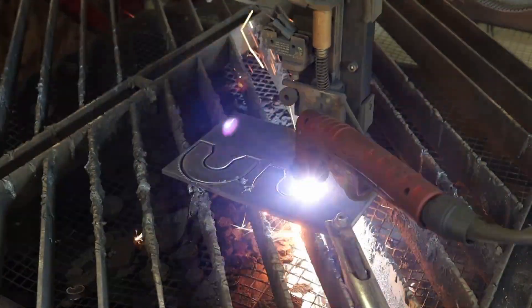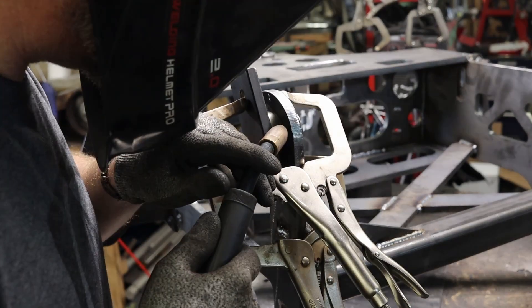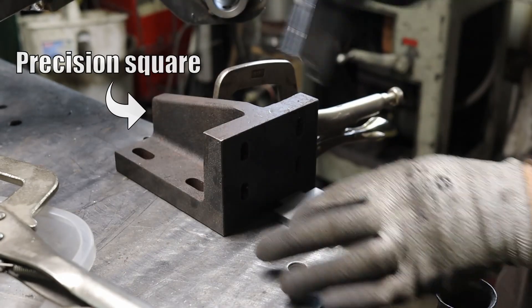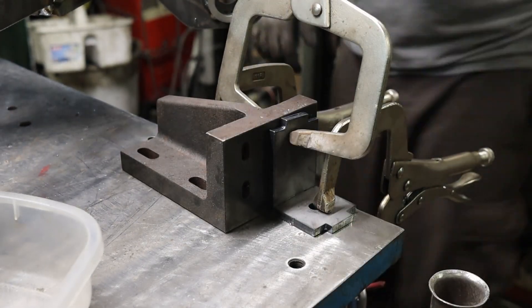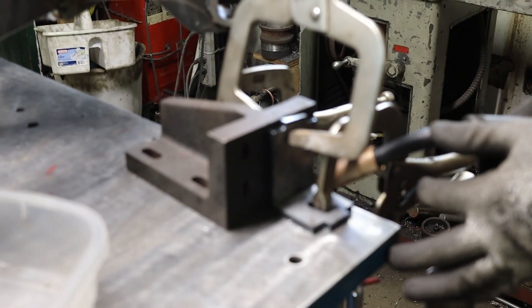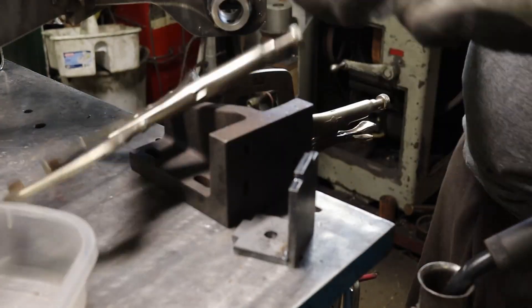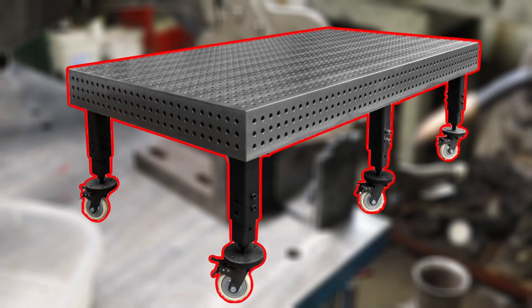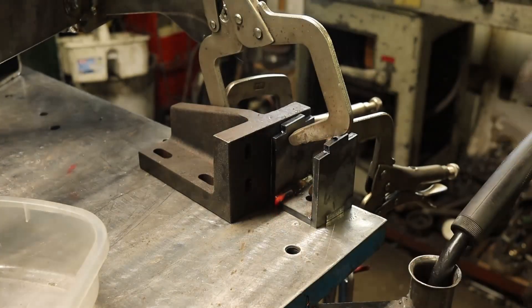These are some of the parts that I forgot or messed up the quantity on, but luckily I can use my homemade CNC plasma table. I often use precision squares to quickly make myself some welding jigs — it makes for better, faster, and repeatable work. For small parts I'm covered with these squares, shims, and 1-2-3 blocks. However, when I need to build bigger parts like a tubing frame, I'm kind of screwed with my setup. So maybe I'll design and build myself one of those 'Swiss cheese' welding tables, just like the one Fireball Tooling is selling but custom-made for my shop. If you have any good suggestions regarding welding tables, please let me know in the comments.